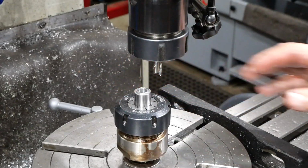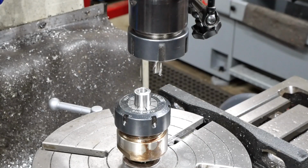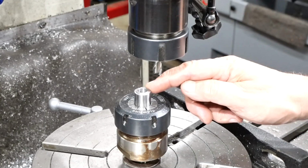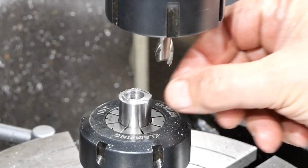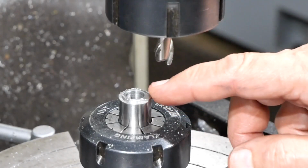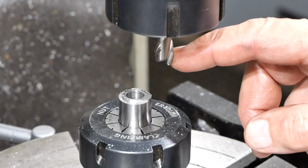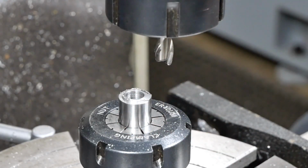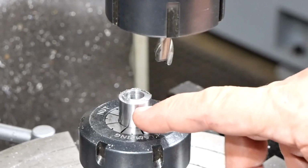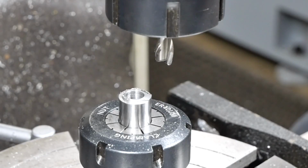Alright, well we've got a bit of raggedy stuff, but perhaps you can see that there is in fact an exhaust cam shape evolving. So I'll get rid of that hairy stuff. But I just realised one thing, what I meant to do and didn't do was use an offset of the required thing plus half the cutter and about 0.1 or 0.2, so I could come back afterwards at full depth and do a single pass all the way around. It's possibly not too late to do that, so even though I've done the first piece here, I will adjust my offset to allow for that. Anyway, you've seen how it's done. I'll bring you back when I've made a lot more progress.